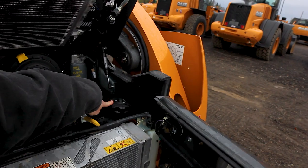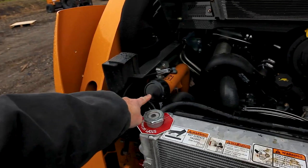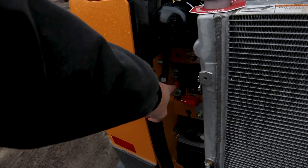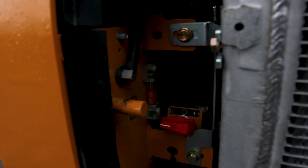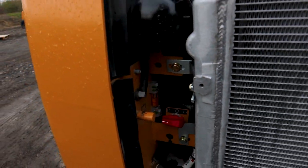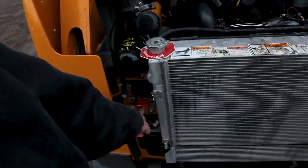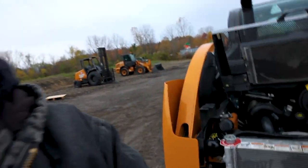Where the fuel is — that's diesel, make sure you know it's diesel and not hydraulic fluid. Over here is hydraulic fluid — again, that's just on this one. One of the checks you're going to do in the mornings is look at your hydraulic sight glass. This machine has it tucked away — you can see there are two red lines on there and you want that hydraulic oil level between the lines.